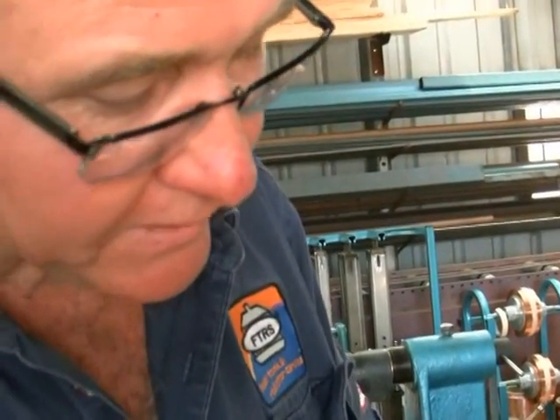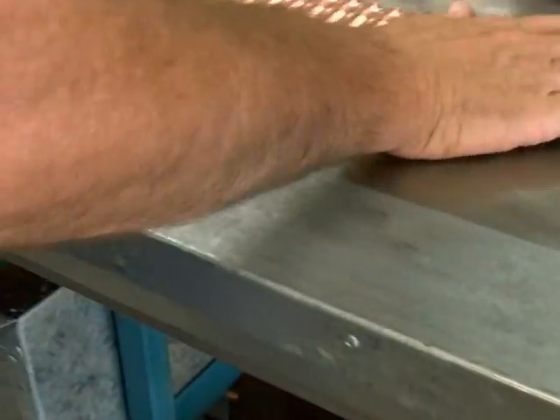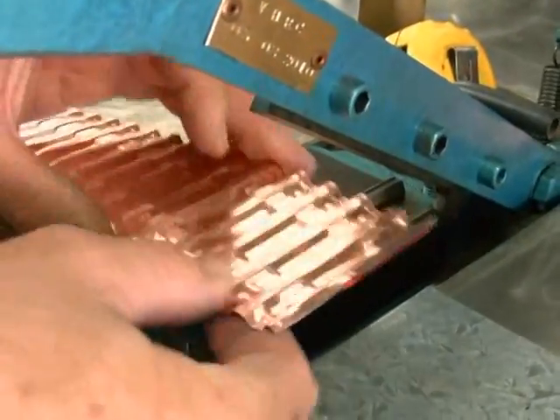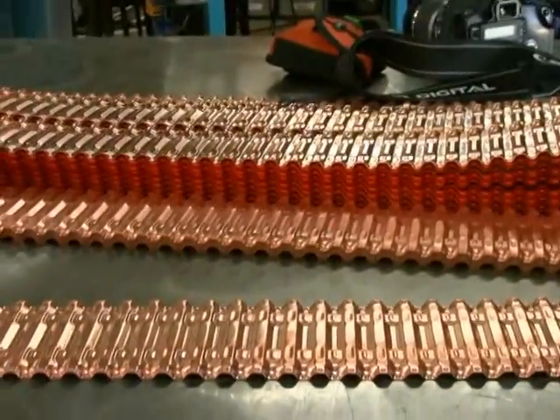When we're cutting from the guillotine, we go through once, move it back, and go through to a backstop — there's a backstop there — and we cut it there. We set it again, cut it again, and keep going through, just duplicating until we build our pile up. When we get enough of these, we'll move on.